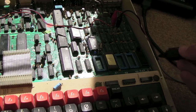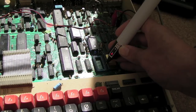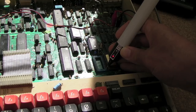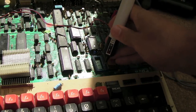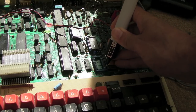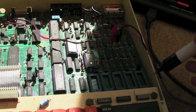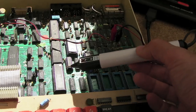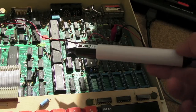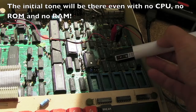I've not got the beeper connected, but looking at the data connections — it's not pulsing now. Yesterday these were pulsing when the ROM was removed. They're all stuck high again, which is very strange. Let me try disconnecting the keyboard in case that's the problem. I've also removed the other ROM chips. Switching back on — we're still getting that tone even with no ROMs in there, which is a clue: you get the tone regardless.